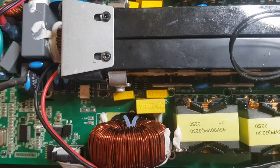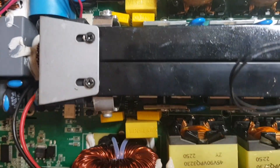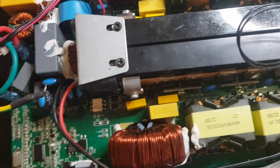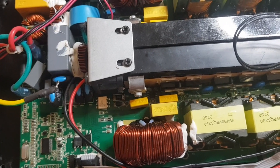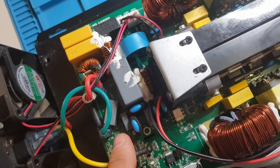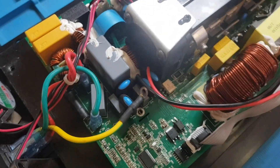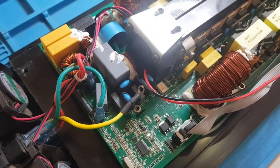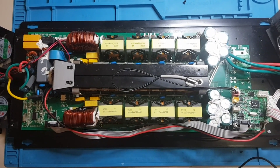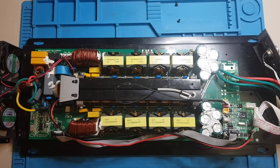Standard procedure: IGBTs, driver, and gate resistor replaced, and I've also replaced all the capacitors here around — the big ones as usual, but this time also the small ones right next to them. I also had to replace the thyristors and triacs, as they also did not show correctly in measurements. Another capacitor I replaced is this one at the input — it looked quite burned and read a little bit out of tolerance. So that was it — deeper damage than expected, but according to the diagnostic manual I should now have correct values everywhere.